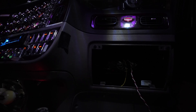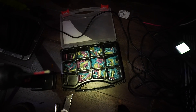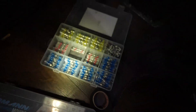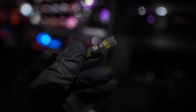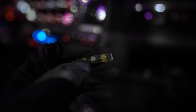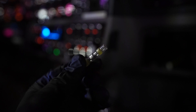If you guys love doing wiring and stuff, I recommend you get something like this — this stuff is helpful. Heat shrink is helpful. And I also have these things — they have solder inside in the middle, as you can see. See the white part, that's a solder. So when you heat it up it melts and it connects the wires — basically solders them. And then on top of that I just run a heat shrink, that's like a double protection. It's pretty handy to have.